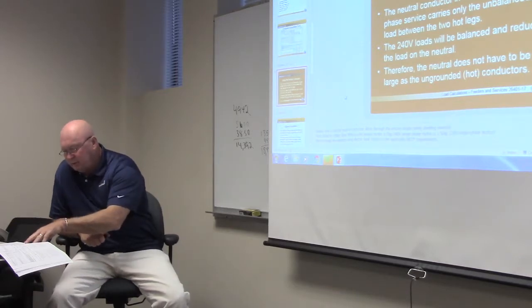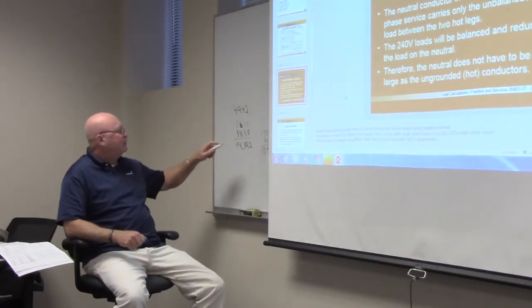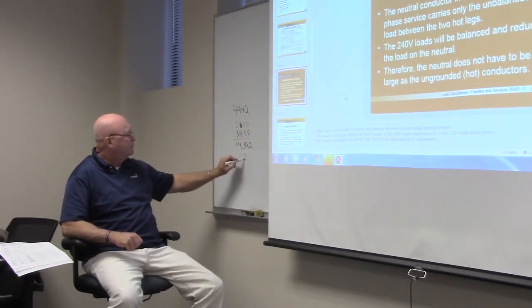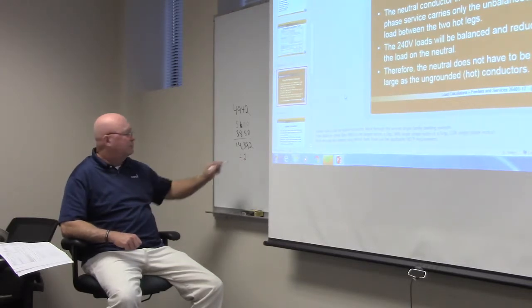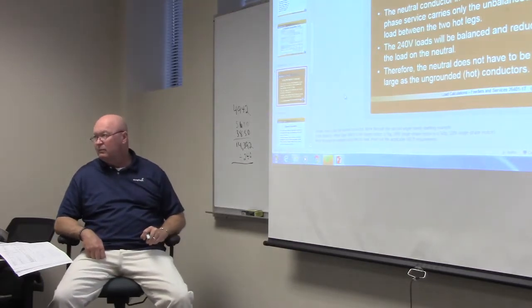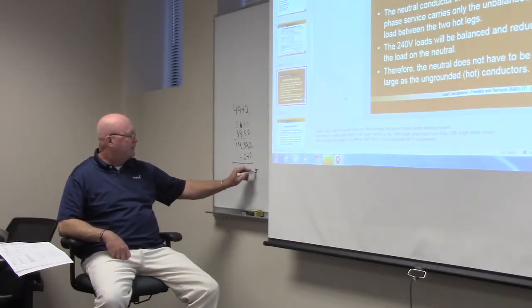And so if we look here then, to find the line-to-line amperes, divide the total amps, which is 14,392, and we're going to divide it by, if it's a 120/240 single-phase house, what are we going to divide 14,392 into? 240. 14,392 divided by 240 is how much? Got you calculated? 14,392 divided by 240 is what? 59.97. Yeah, or 60 amps.